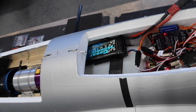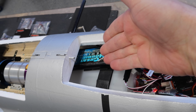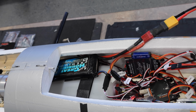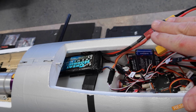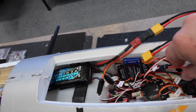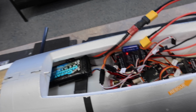Okay, so initial power up here, we've got good things happening. So we've got the one battery. This isn't our battery we're using. This is just a test setup battery. We've got the battery plugged into the BEC. Now, it doesn't matter which side you plug the BEC into, everything appears to be getting power. So it looks like it's a double battery setup. So what that means is we can just shorten these, put them together and make it a very simple setup,